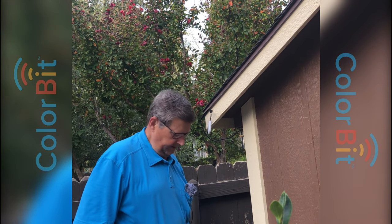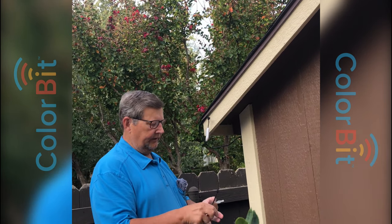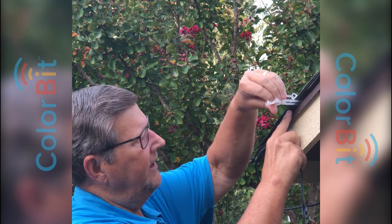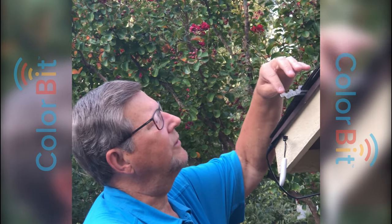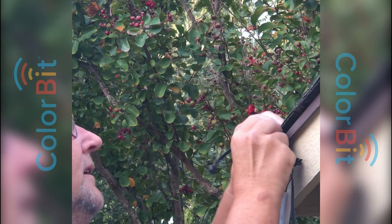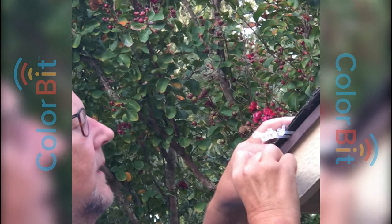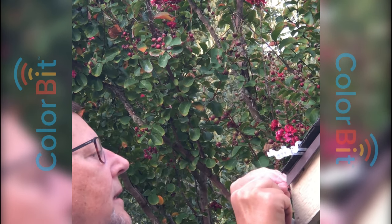We're at the roof edge here now. We're going to begin the installation. I have my clips and I have my lights. I untangled them pretty well and we'll continue as we go. The first thing we're going to demonstrate is the clips going onto the roof. What we have here — we've got the shingles, we can see that lifts up just a little bit. You don't want to tear it too far so you rip it up. All you do is just take it, work it under there a little bit, lift it, push it on. There's no drilling, no holes, no nothing. You can see it's pretty secure, and then you're going to put your wire in this little crease and this will go up and click. I have my controller — this is the controller from Colorbit. I'm going to take the male end and put it in the female end of the controller, and I'm just sticking it up under the edge here so I can work with it.